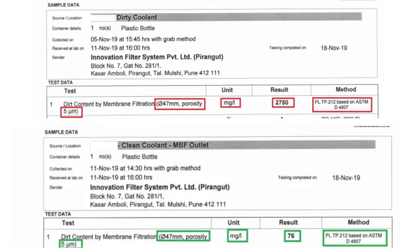All this tramp oil gets added into your degrease chemical when the component enters the component washing machine. The function of the machine is to remove not only solid impurities but also tramp oil. The tramp oil sticking to your components enters the cleaning chemical, starts floating over it, and builds up over time. When this chemical is pumped onto components, instead of removing dirt, the tramp oil causes dirt to stick to the component even further.